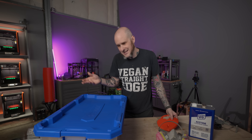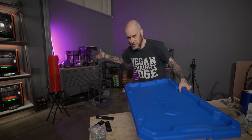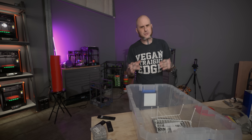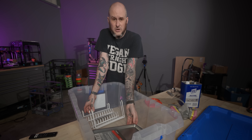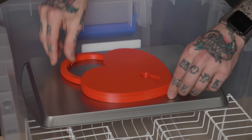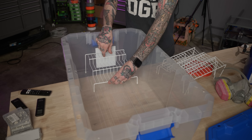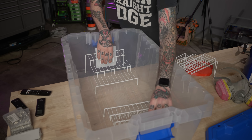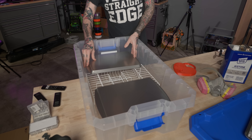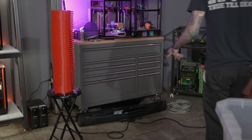When you're gluing things, that's fine and kind of necessary. When you're trying to smooth these out and get a pop art look, it's anti what you're trying to do. We could also dunk our hearts into acetone, but that's also difficult to control. Vapor is slower, but it's going to be a lot easier to manage. I ran to my local dollar store and picked up some cheap cookie sheets for around $1.50 each for our tray, and these spice racks to elevate things up off the bottom of this vessel. I'm going to set these wire racks in here so we're elevating our pans up off the bottom — we're not actually sitting in acetone, only having the vapors circulate around what we're trying to smooth.